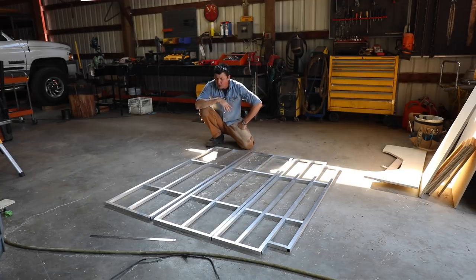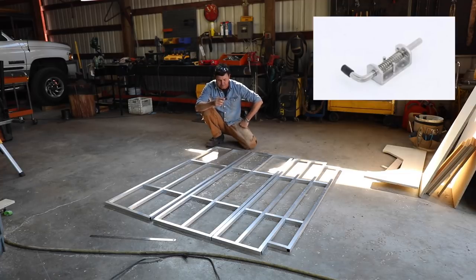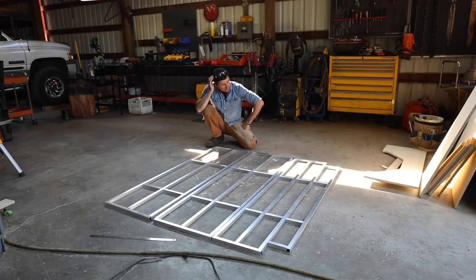We'll pick it up on the next video when I get the welder — we'll do a video on TIG welding and I'm really lucky to have Brian to show me the ropes. How I'm going to hold these panels in so they don't fall out or bounce around is spring pins. A spring pin will weld to the bottom of one of these channels and go into the aluminum channel ledgers on the side, pin in, spring in, hold it secure, and be easy to put in and take out. Thanks for watching and we'll see you guys on the next video.